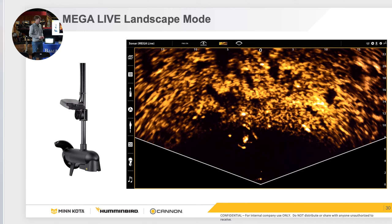One important thing on Megalive specifically — make sure everything is off auto, whether it be the degrees you're tilting up or your display mode. Don't leave any of those in auto; put it all in forward mode and set whatever degree or number of clicks you want, turning those off auto. To change from forward to landscape as you tilt the transducer up, it's simply clicking the menu once. With Solix and Apex you just go up to the top bar and quickly change it.